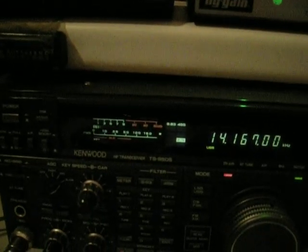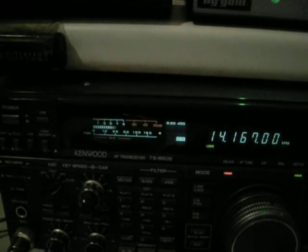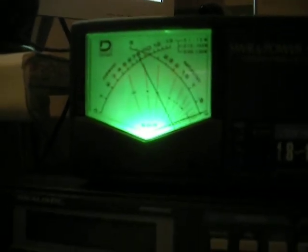The drive power, as you can see from my TS-450, is around 60 watts normal and about 80 watts peak PEP. This is a test on 20 meters, not using a lot of compression. The setting is 1.5 kilowatts max and the PEP circuit is engaged, built in by myself. This is not a standard unit — it's modified, as you can also see by the green LED light. You can transmit for a long time and the power output will not decrease; it'll still remain at 800 watts plus on all the bands.